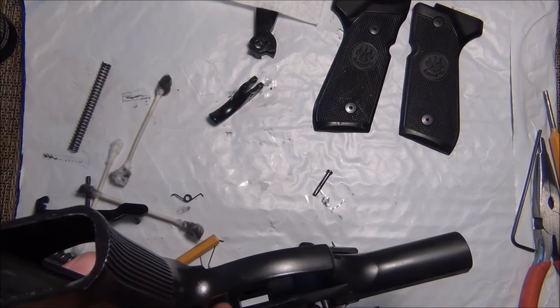This is the trigger bar. This is an overly complicated trigger bar spring — the way this interlocks is, this is exactly the orientation it's going to go in. You see this very crude canal here? That's where that spring goes, right in there. So this is kind of a silly idea, but I didn't design the gun, I just work here. So I'm going to oil this just a touch, not that it really needs it in there, but just for good measure.